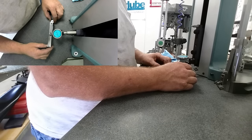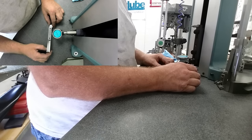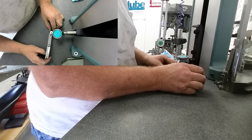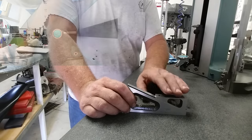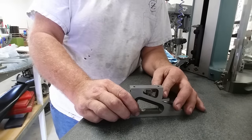All I'm going to do is run it up here so that this sits proud, and we're going to block it up in the grinder with some 1-2-3 blocks on each side — just give it some packing — mag it down and just dust off that top. We're going to securely tighten our little screw here and clean up that top. It only needs a thou and a half, so no big deal.